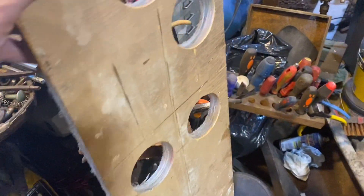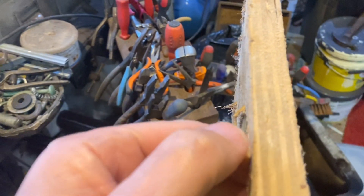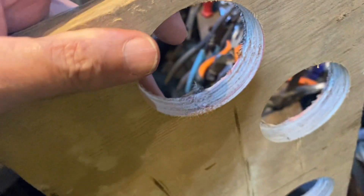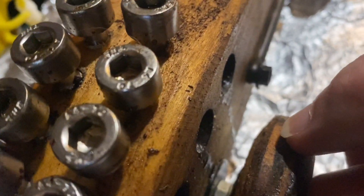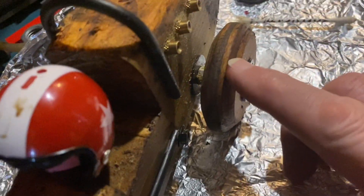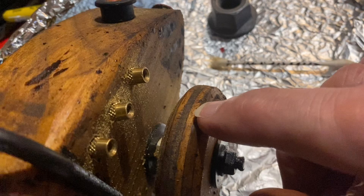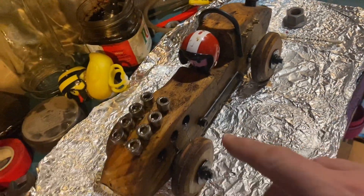We made the wheels by drilling them out of plywood — seven-ply plywood, one two three four five six seven layers. We cut the wheels out, and because there were seven plies it was very easy to trim the edge: leave three in the middle, take two out of either side. We just followed the line of the ply on the sander, which made creating that wheel shape a lot easier. I sort of accidentally fell across that method with the plywood.